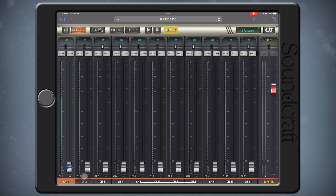Then, going back to the Main Mix page, we can see that our Synth is now making it into the Remote Mixer. For more information on the Patching screen, check out our Patching video. You can mirror all of your inputs from one Mixer to another this way. A simple setup like this could allow you to have one Mixer acting as a Monitor Mixer, letting your Monitor Mixer have its own stream of post-preamp inputs with full Mix and DSP capabilities, separate from the front of house.